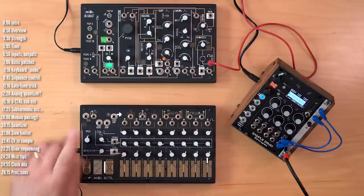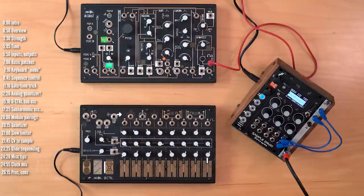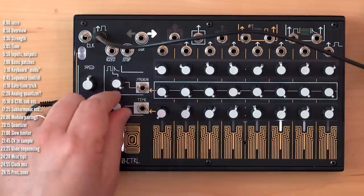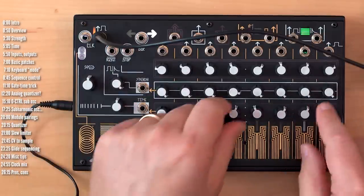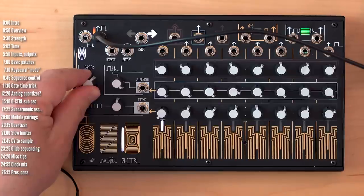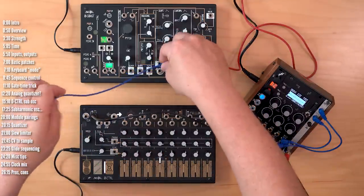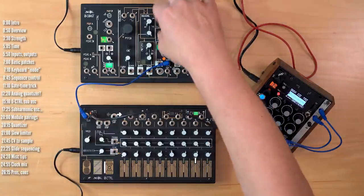One last thing I promised we'd check is what happens to this output when we mix an external clock together with whatever is going on with timing here. To listen to this clock, I'll plug it into the hi-hat here. So timing here, as you remember, obviously impacts the way the clock runs. And that clock gets sent out here based on whatever timing you choose here relative to the overall speed here. If I lower this down and plug in an external clock for this, I'll just use this envelope and get it to loop. So that's my clock here.